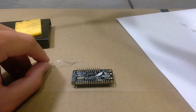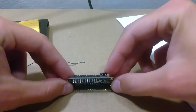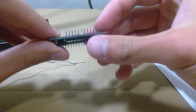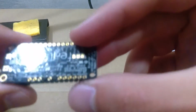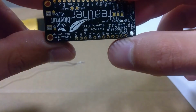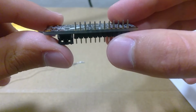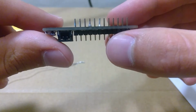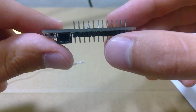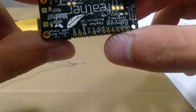And there we go. You don't need to use a lot of solder, just enough to get a solid connection on both sides. If again, we zoom in, in this case, it's the one on the left. So, 13 there. If you look at it from the side, you guys can see that it has that volcano shape. That one's not as pretty as the first one. You guys can see that the first one is shinier, but it would still have a solid connection.